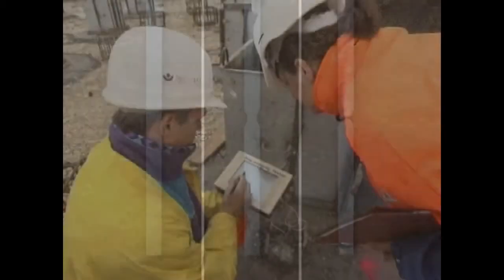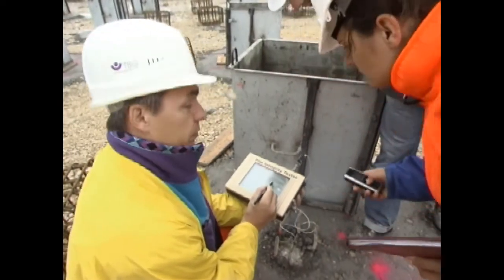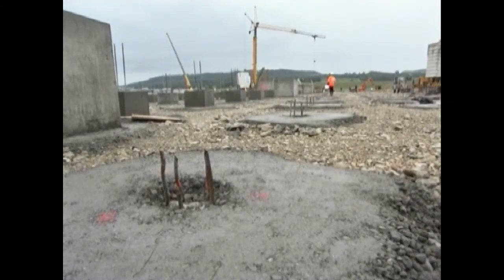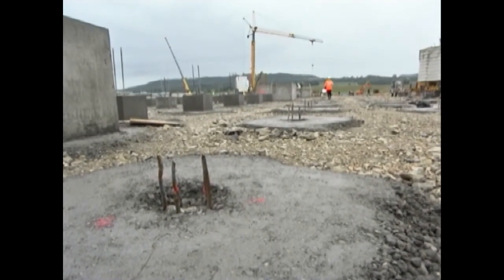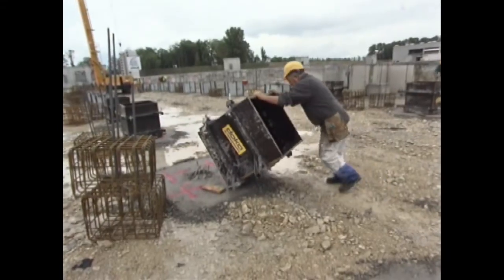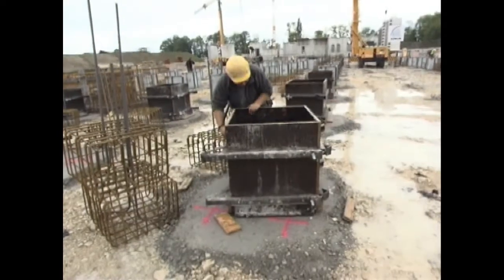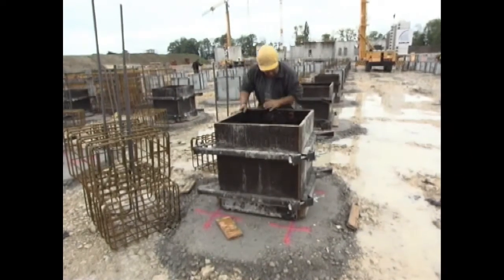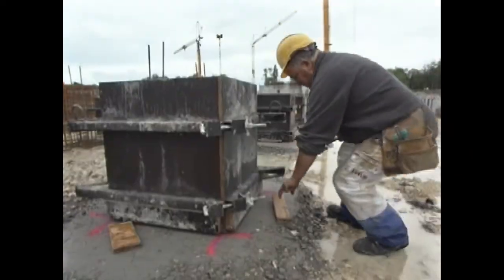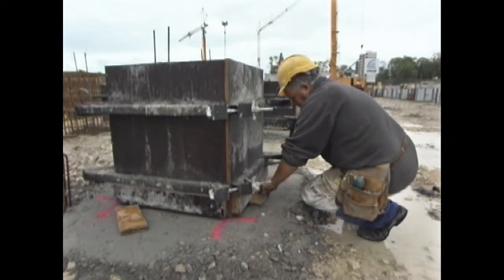On this job site, 2 vibrating units were applied for 5 months and 1 more vibrating unit for 3 months. Every machine produced an average of 2 piles with a length of 35 meters each per hour. Thus, on this job site, 7,500 piles with an overall length of 270,000 meters were produced in only 5 months.